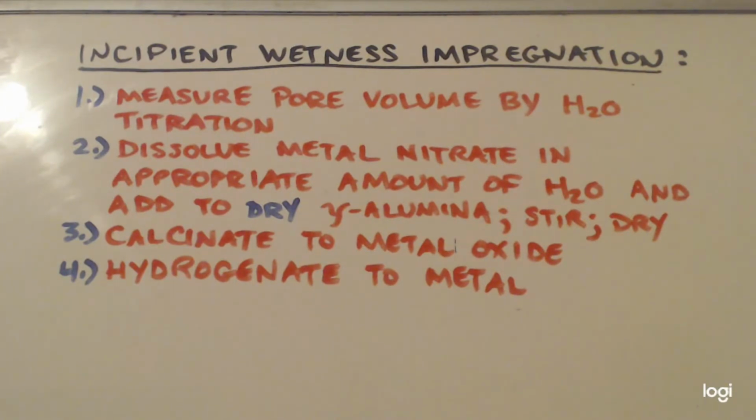You know, have some hydrogen going through. I'll get a video where some guy hydrogenates metal, and I will put a link to that in the description below, so that you can see someone actually doing it. Because you can really blow yourself up hydrogenating metal if you don't do it right. But basically, you just heat up the furnace tube with the metal oxide in it that's on the alumina, and the hydrogen will make sure that all the metal oxide turns into metal. Now you'll have metal on all the surface area of that gamma alumina.